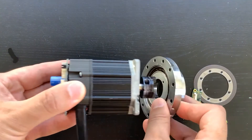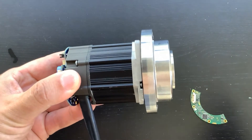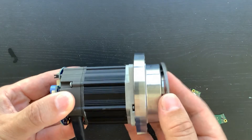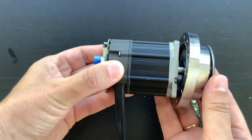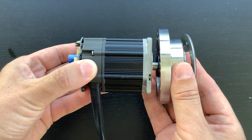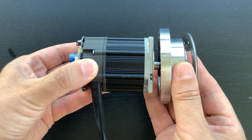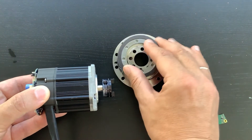Now let's put together a mock-up of a typical servo drive. A Servosila brushless motor controller drives a frameless electric motor. The electric motor drives a Servosila harmonic speed reducer. An absolute rotary encoder feeds the brushless motor controller with an accurate measurement of the position of the output shaft. Note that it is also possible to build a direct drive servo that does not have a speed reducer.